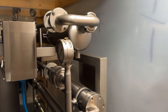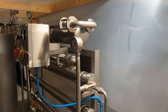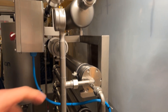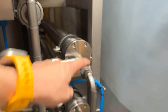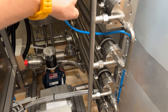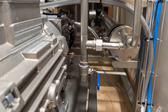You have a pressure gauge to see what the pressure is at for your permeate. Usually you shouldn't see any pressure on your permeate, but if there's an abnormal operation of the system you would be able to identify that there. The permeate — whatever makes it through the membranes — would come out of here, and your concentrate would come out of here. So you have four permeates — one, two, three, four — and you can follow this tube all the way to the tank and draw off there, or you can draw off of here.